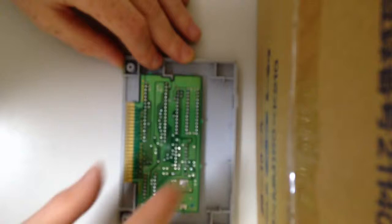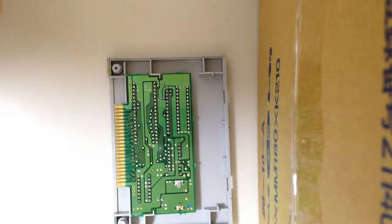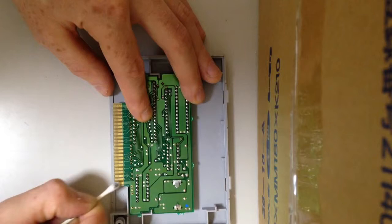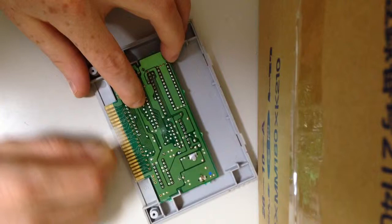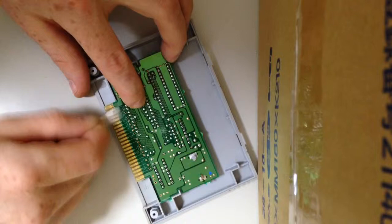So I click this PCB back into the little holder thingies here and I get a Q-tip or cotton bud and just spray it with a bit of alcohol. I just rub and you can see the end of it just turning black, so you really need to give it a nice good rub. Just try to use as many ends as you can — don't keep rubbing with a dirty Q-tip because you'll end up just spreading dirt instead of cleaning it. Don't worry about Q-tips, you can get them from a pound shop or dollar shop.